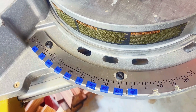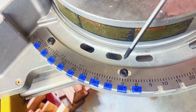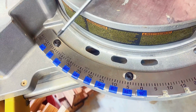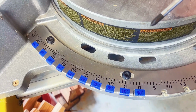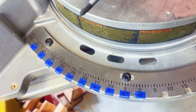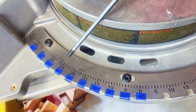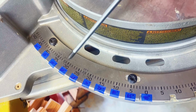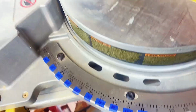This is why a lot of times people don't think about all of these in between, because as a beginner, you don't use all these random degrees. You're either doing a straight 90 or you're cutting 45s. But as you grow as a carpenter, you're going to want to start using all of these odd miters, and you may have already run into it. You may have gone to cut 30 degrees, and whenever you put your pieces together, they just don't match. It does not work. The reason why is because you've actually put a 60 degree miter on the board that's against your fence.